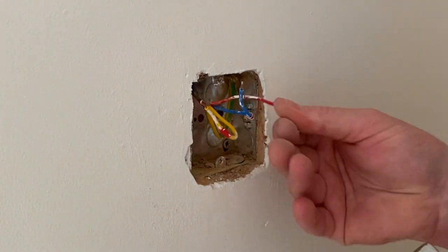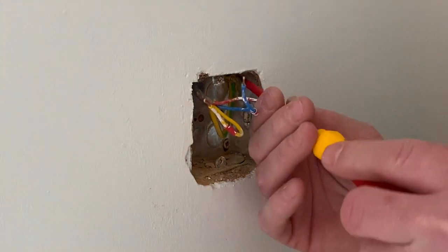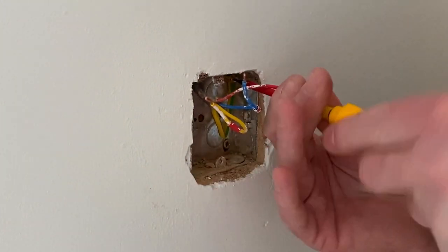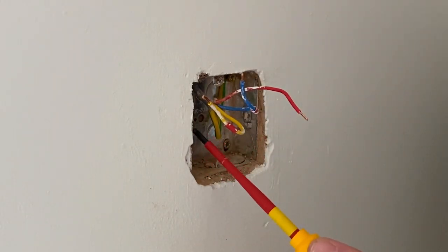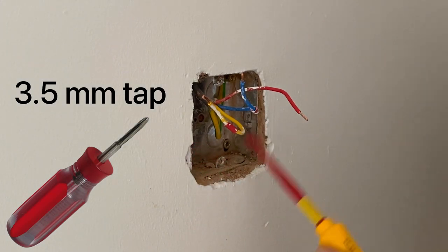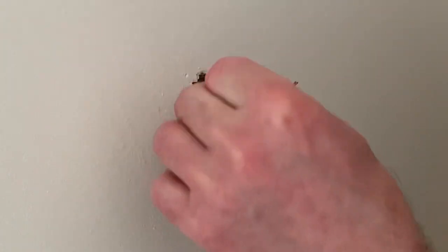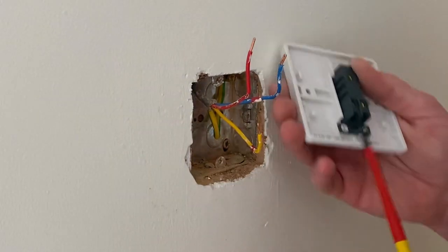Connections are made and ready to go. I'm going to check that the CPC is actually connected properly — confirming it's in the copper itself and not just in the sleeve. That's nice and firmly in there, a lot tighter now. I might need to clean out the threads with a 3.5mm re-threading tool, but they look pretty good on this one. I can now fit my new two-way switch using yellow as common. Remember, it doesn't matter which is L1 and L2 — it's just what colour was common, and in this case it's yellow.